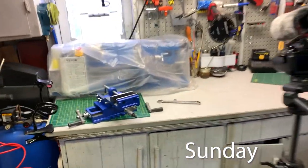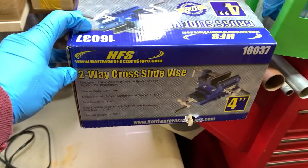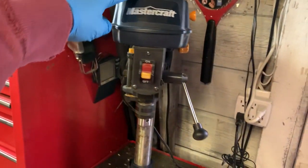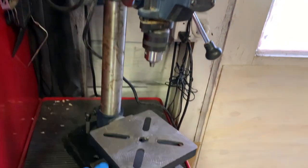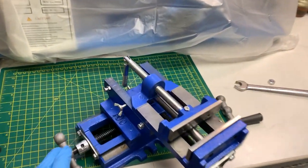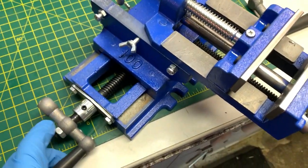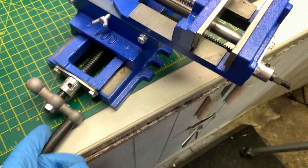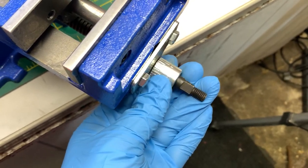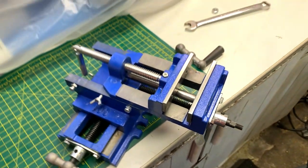Garage time again. Got a cool little thing — check this out. This is a vise, a two-way cross-slide vise, four-inch version, that I got cheap off Amazon to go with my Facebook Classifieds find of a drill press. What I'm going to do is turn this into a poor man's milling machine — we'll see. Off the top it's pretty chunky so I need to free some things up and re-tap some hardware. It's got a big burr on the end where it was smacked, so I've got to run a die down that and fix it up.